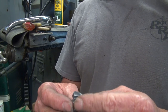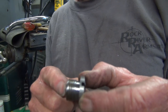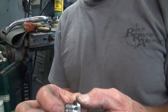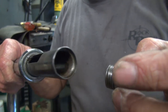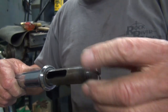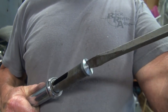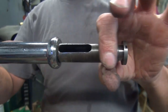I finished the throttle grip screw. This threads into the end of the handlebar — it's got 9/16ths-16 threads, and I cut a screwdriver slot across the top with a milling machine. That little piece is probably three-quarters of an inch long. Here's the handlebar — you can see the threads in there, which are also 9/16ths-16. The plug that I made screws right in there. Take a screwdriver, put it in there, snug that down. It comes right out. This holds the grip on so it doesn't come off.